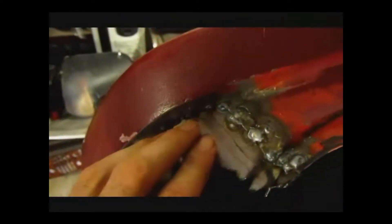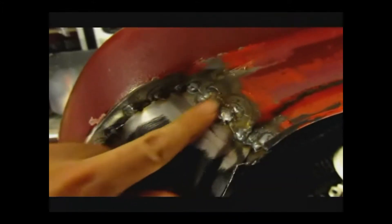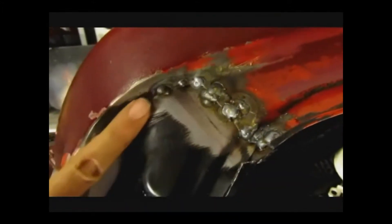Reinforced it and welded in there. And then over here on the side, there's some welds. And then all this gets ground down. And then I use some metal filler to fill that in and it makes it nice and smooth. And that's why there's this bevel here so that you can fill it with a filler. Same thing here — you do the filler on the side and then smooth it out right here in this area.